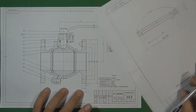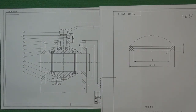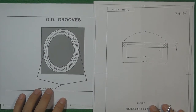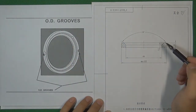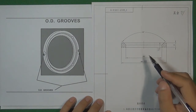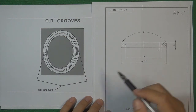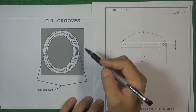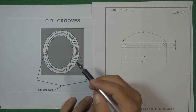This is one kind of valve seat design in the soft seat ball valve industry. But some manufacturers will design different valve seats — the shapes are a little bit different. They will add two outside diameter grooves on the outside diameter of the valve seat. In this video, we're going to talk about the disadvantages of the old design and why we need to add outside diameter grooves, and what the advantages are for this kind of valve seat.